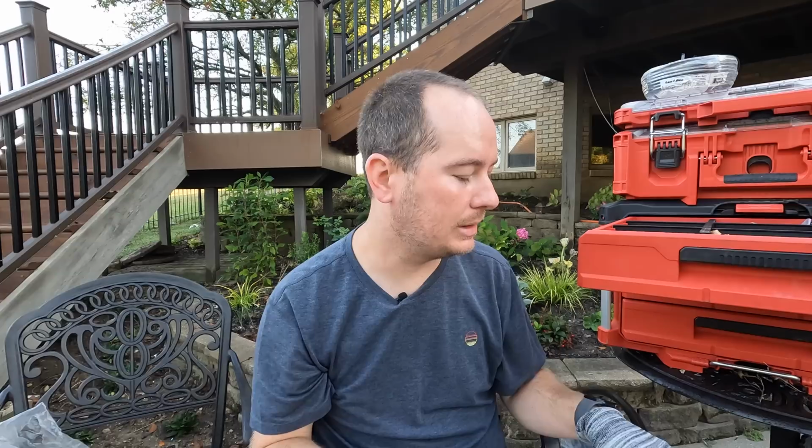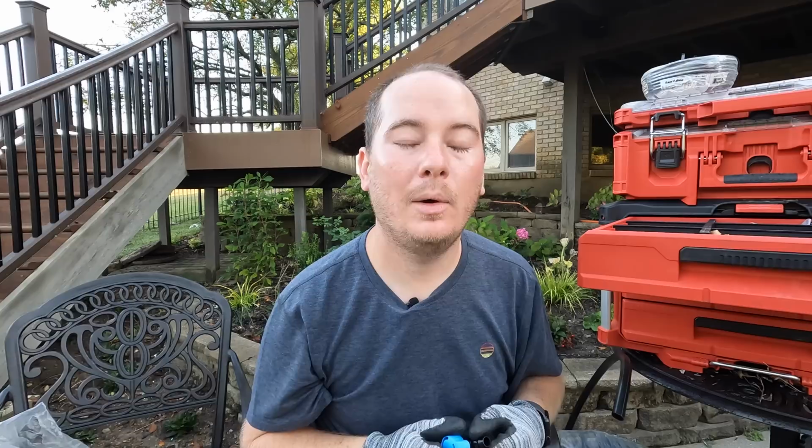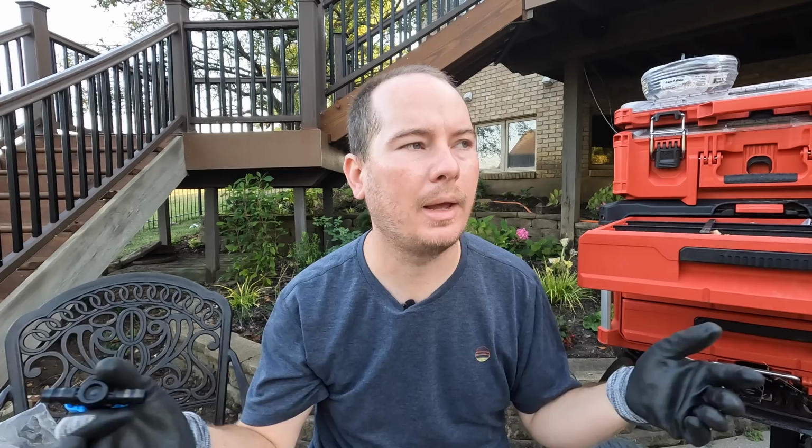People are concerned oftentimes, and in the last video I don't think I covered it, about whether the system has to be winterized. No. My system was blown out as part of my regular irrigation being blown out at my last home, with pressurized air is what I mean. They come and put pressurized air in and blow all the water out of the system because it gets really cold and it can damage PVC pipe, which doesn't have any flexibility. Because your system has emitters all in it, if there is a little leftover water, you don't really have the concerns of it freezing and busting.